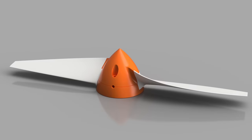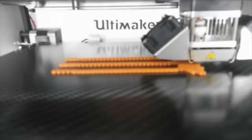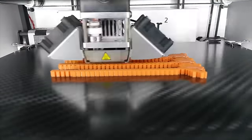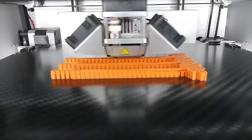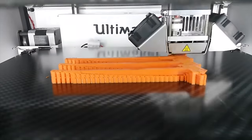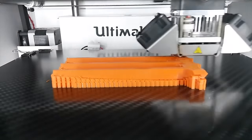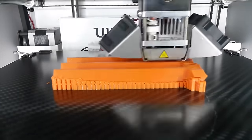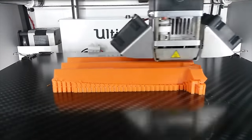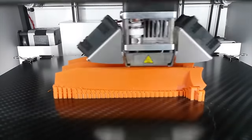So I decided to 3D print a two-blade propeller with only 3 inch pitch — that's one inch less. The propeller blades are printed with the nose pointing towards the build plate. This orientation is needed in order to withstand high centrifugal forces. It's also important to print all blades in one pass, because small variations in filament density could cause differently weighted blades and an unbalanced propeller.